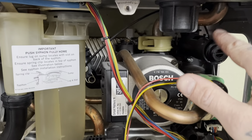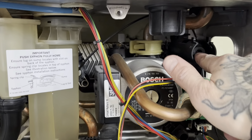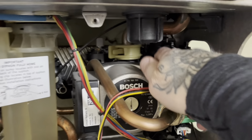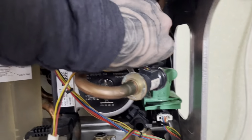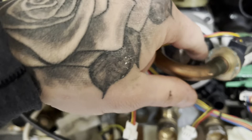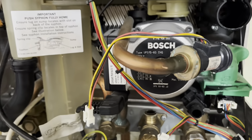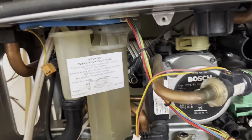This was the old one - I mean this is plastic, and only cold water goes through that. The part you used the pliers to pull out - obviously keep that to the top again. Push it in and you'll hear it locating - you'll hear and feel it. One hand in - there we go. Got to take this flow sensor now off this hose pipe. I'll just get a little flat head screwdriver and just part them, just makes it easier to put them back together.